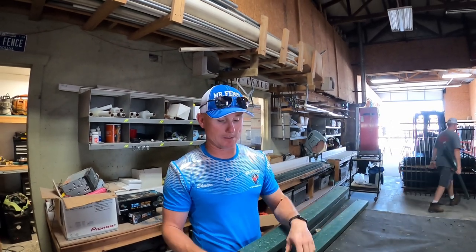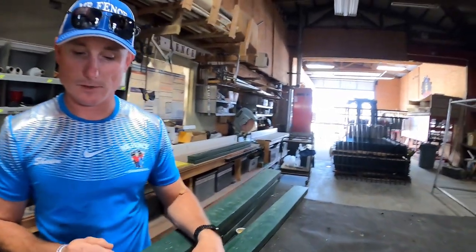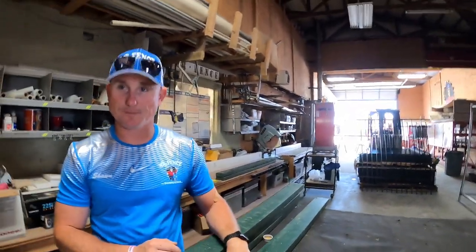We have Sure Sets on the trucks, which are adjustable and do all of that. But what I've noticed over the years, the guys get tired and relax and don't want to change the setting on the Sure Set from 91 inches down to the 4 foot, down to the 5 foot for the gate spacing. So if we just put these in the truck, years ago when I ran a crew, it was on the truck. You have to teach them to hold it level. It'll be fine if it's flat, but not if you're on a big slope.